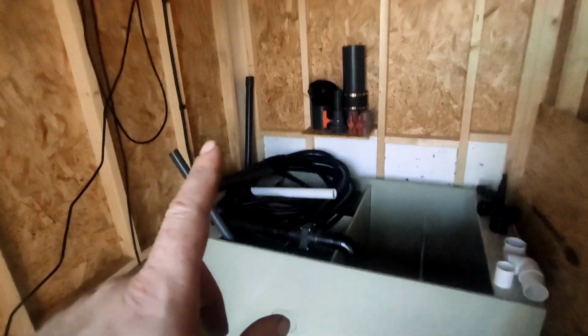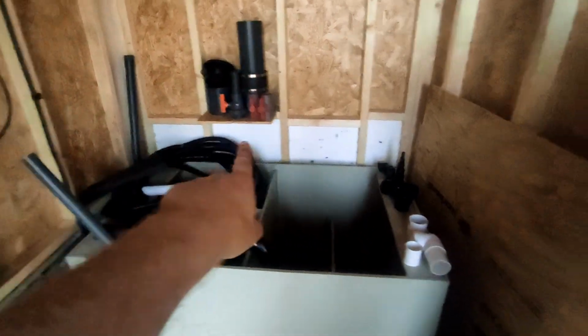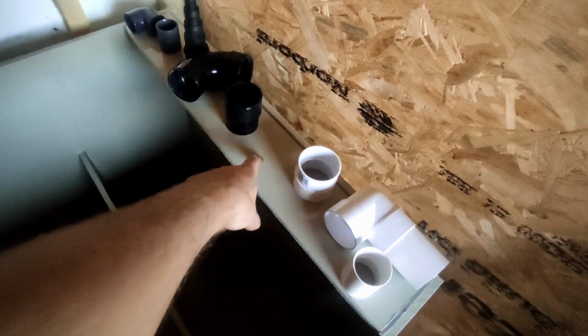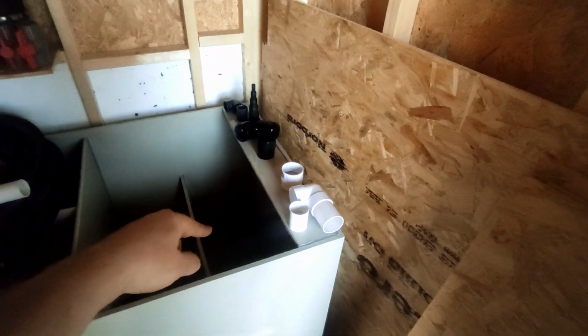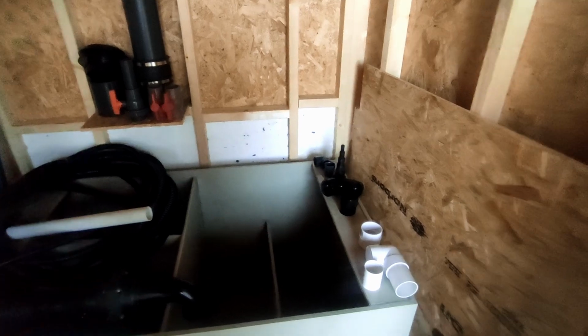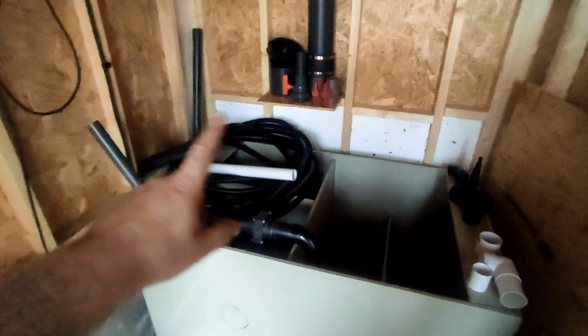Next thing I think I'll probably do is get this. There's the feed pipe here that goes down to all the valve pipework and things to the pond itself. I think I'll work out a way of getting that over to this side of the pond, or to the tank. I will drill a hole in the top of this section, I think, so I can have the pipe going in to gain access to the pump, but then I'll be able to put a lid on and take the lid on and off without actually having to disturb the pipework. That's the plan. We'll see how it goes with a little bit of fettling. So yeah, I'm going to crack on, I think, with that pipe now.